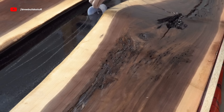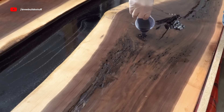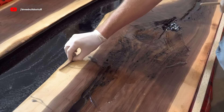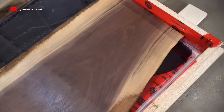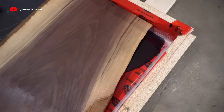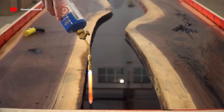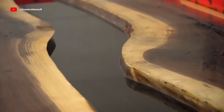If you want to pour it all at once you definitely have to clamp your pieces down. I'm just pouring about half of it and then letting it mostly harden before I pour the rest — that way I'm not risking all the epoxy if the mold has a leak, and the mostly hardened epoxy will hold the slabs down so I can just pour the rest right on top. After about 20 minutes I'll take a torch and pop any air bubbles that have risen to the surface.